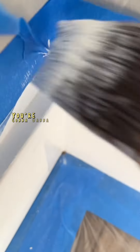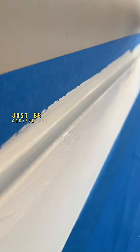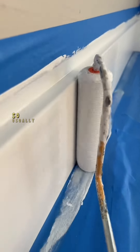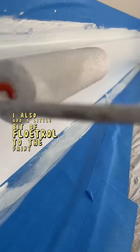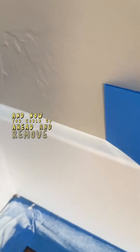Now it's time to paint. You're going to want to let the caulking dry for about 30 minutes before you start painting so you don't dig out the caulk from the crack when you're painting. The baseboards here were spray painted — the homeowner didn't want any brush marks, so what I do is get a foam roller. I also add a little bit of Floetrol to the paint because the foam roller does leave a little bit of texture, but that Floetrol will make it look like it was sprayed. Now you can go ahead and remove the blue tape.